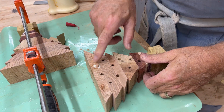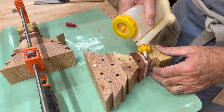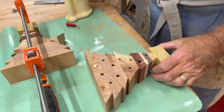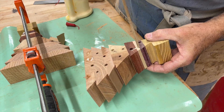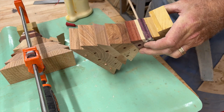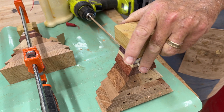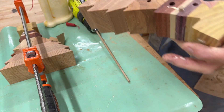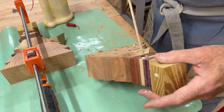The key is to put these dowels in without them breaking off like this one did. I'm going to put a little bit of glue in here and have it run through there. Then I'm going to screw this one in gently until it comes out the other side. Then I'll just take a saw and cut it off, and let that set. We'll keep going through here.